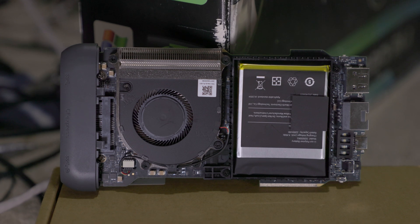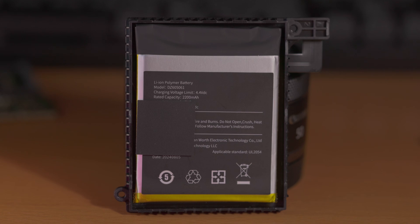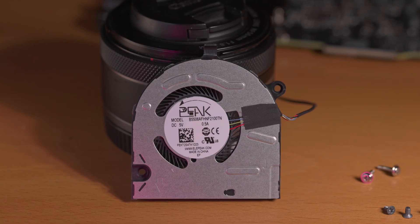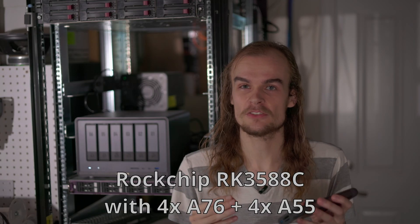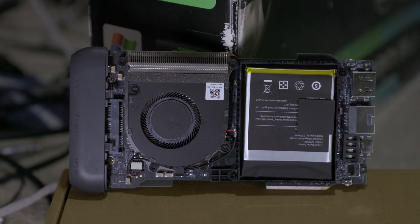Moving over to the other side of the board, there's the battery — unfortunately it's not a standard size and is not user-accessible, which I really don't like to see in devices like this. On the other side of the board is a cooling fan and heatsink that keeps the main RockChip SoC cool. This is a RockChip SoC with a 4+4 CPU using ARM architecture, as well as an NPU and GPU for a little additional capability in some applications. I didn't see any thermal throttling, likely because this cooler is kind of overkill for what is probably a 5-watt TDP chip.